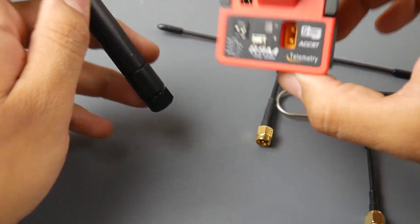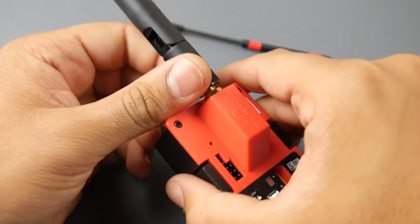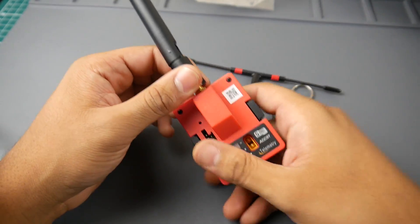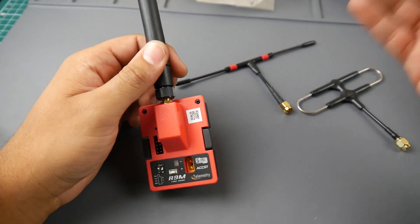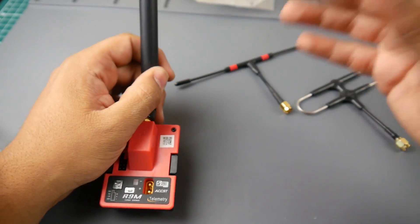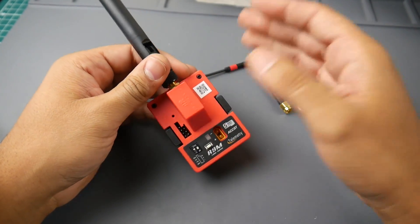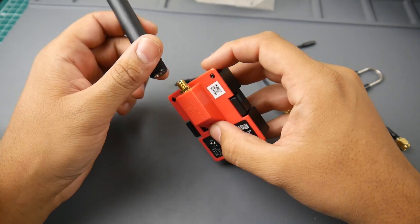The combo I got came with the R9 module and one antenna, and in terms of distance — currently up to three kilometers — I still don't see the need for any other antenna, it's doing that good. But soon I'll be going further, which is why I have additional antennas coming in. I want to do a real hardcore 100 milliwatt or 500 milliwatt range test to see how far we can go with specific antennas. For the longest range, point your antenna straight up — I've noticed that with 2.4 gigahertz and it should translate to 900 megahertz as well.